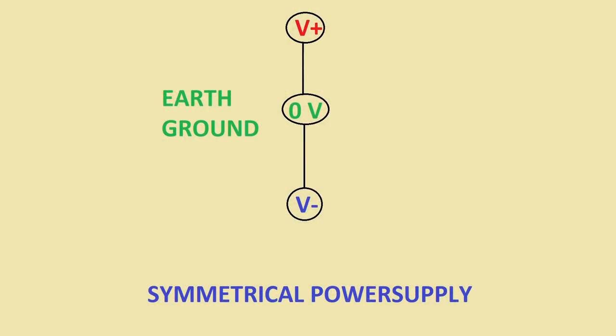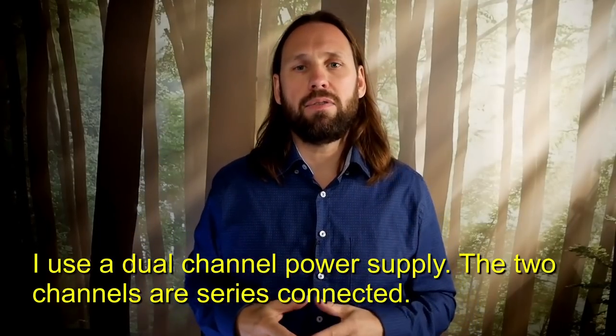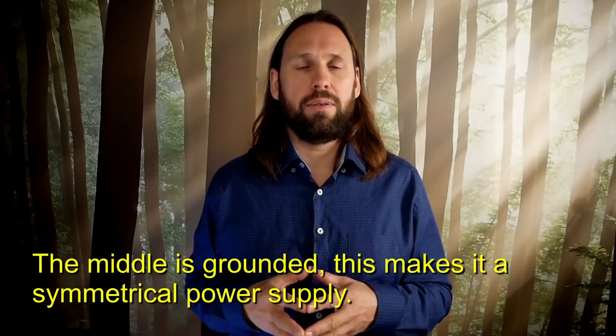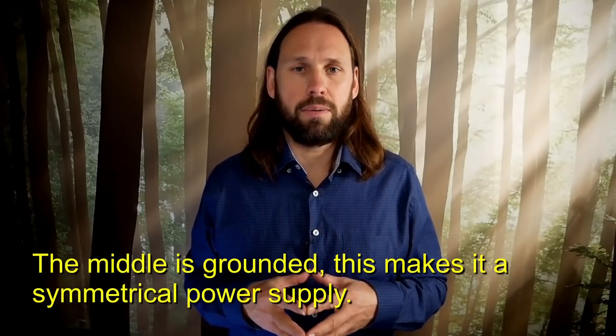We will need a symmetric power supply, because the ground of the L1 and L2 coils needs to be in the middle between the positive and the negative voltage supplies. This way, the alternating impulses are generated by L1, and the L2 is made series resonant.